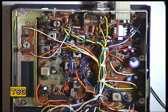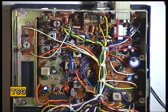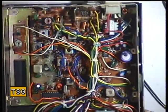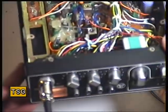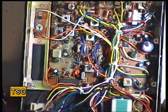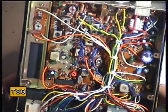It certainly isn't as sensitive as yesterday's Harrier which we did - that's 0.3, 0.25, 0.2, and then you've kind of lost it in the mush - but that's far better than the manufacturer says it is. So it's a good example. We'll set the signal generator to 100 microvolts which is S9, and we'll check the meter is reading S9.